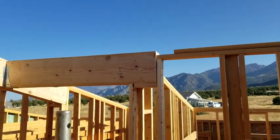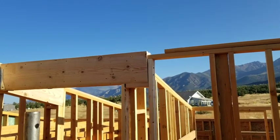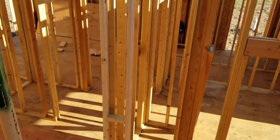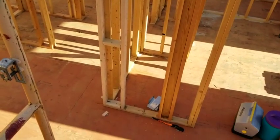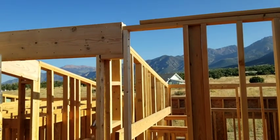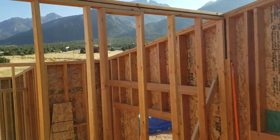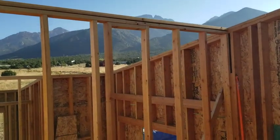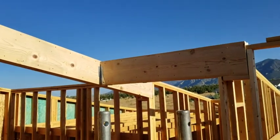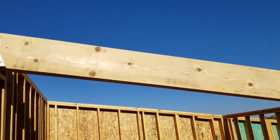Across there, that one down there is bolted to the wall. These two are bolted together with the joist hanger, and then this one here has bolts also holding that together. It took a little extra time yesterday because I had to go and replace these two beams — those two studs — because they were too warped and not going to work out. And when I did that, this wall here went a little crooked, so I had to take some time to get that straight again. But yeah, these beams are all up, put together, and everything's secure.